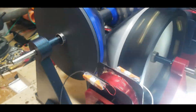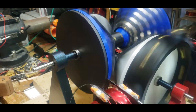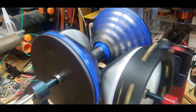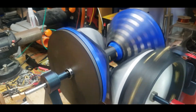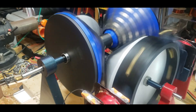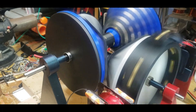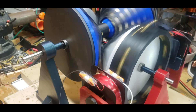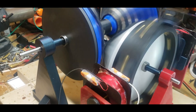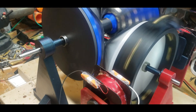So I can get it to sync in any direction, so it doesn't matter. Now it's going this way and this one's going this way. I thought before I could only get it to sync in one direction, which didn't make any sense to me. But when it gets that pop-pop-pop sound — that perfect cadence — that's how I know it's synced up and it's going to stay that way. It does it every time now. It was just a matter of changing it from attraction to repulsion mode, and I think if I get the spacing better it'll just run overall better.